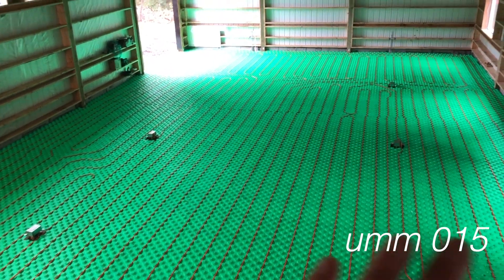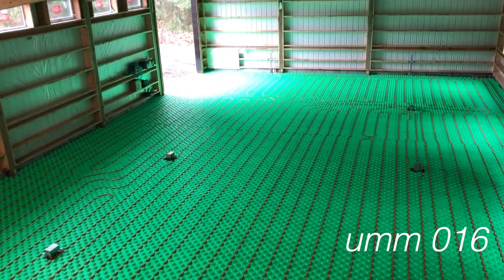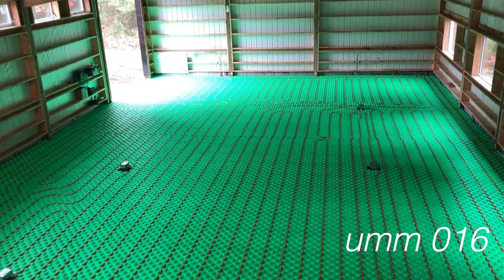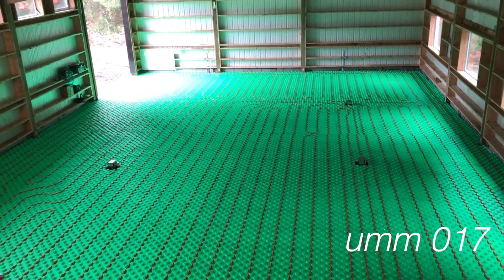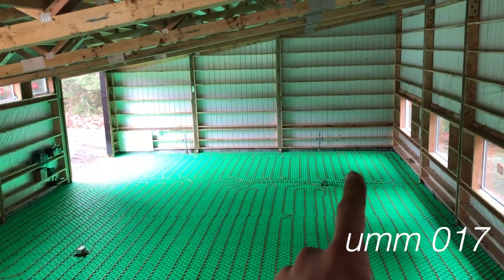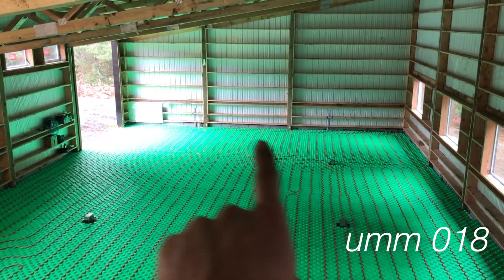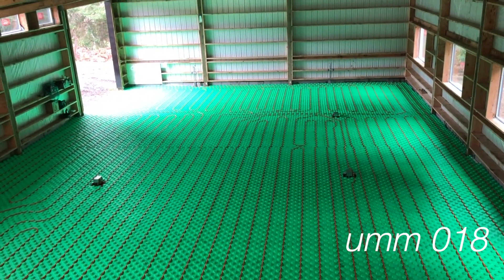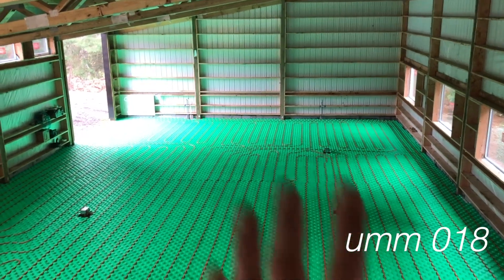It's all going to be one zone, which means it'll either all be on or all be off — we can't have differential temperatures because we only have one water heater. But even though it's one zone, there are multiple circuits. A circuit is a loop — a 300-foot loop of PEX. I'm using 300-foot-long, half-inch diameter PEX lines. I have three circuits at the back that all come down to the manifolds. Each circuit has its own ball valve and I can limit down the flow to that end region, keeping it as a cold side if I don't want to use heat over there too much.